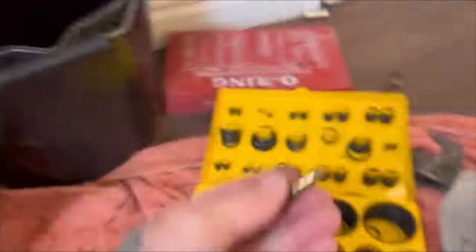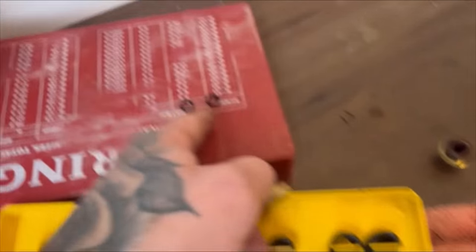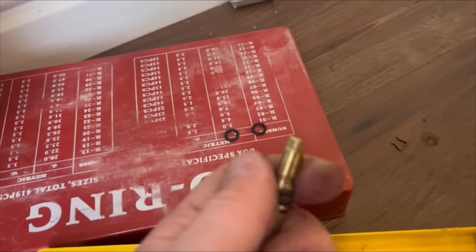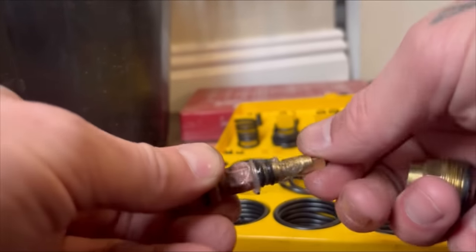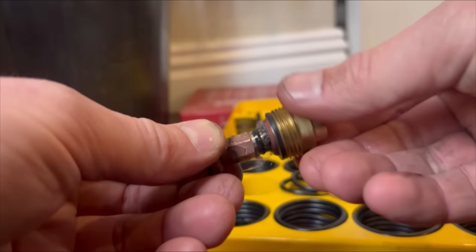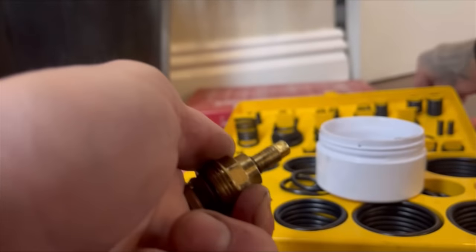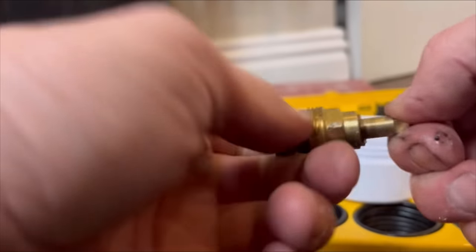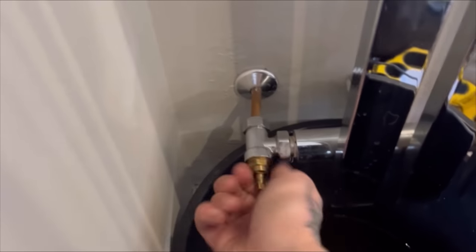So this next one we've been called out to is one of these tall old radiator valves, leaking from the spindle. So I've just stripped it down like you would any other tap. It's got a rubber washer on the bottom there. But basically it's these two O-rings, they're the old ones that have failed. So silicone grease all this up now, put it back together, and hopefully, famous last words, should be all right. A bit of luck. That should be it. If not, it's a new valve.